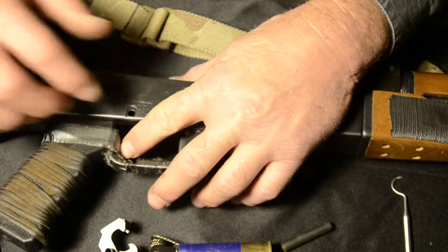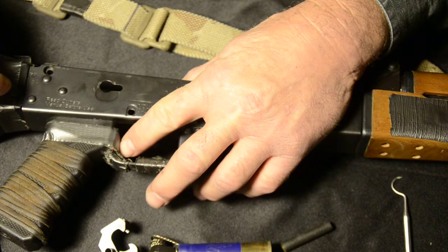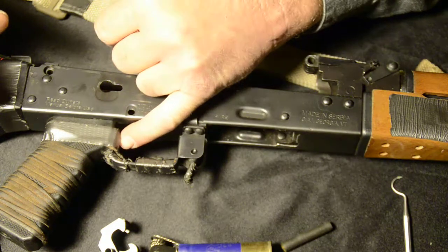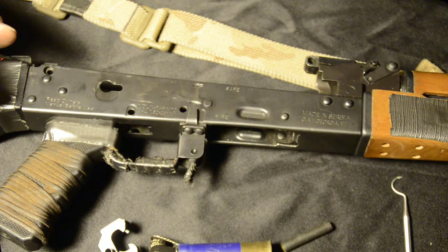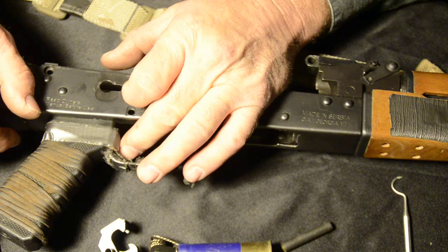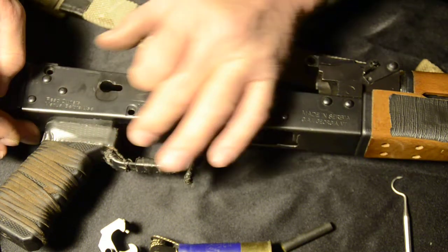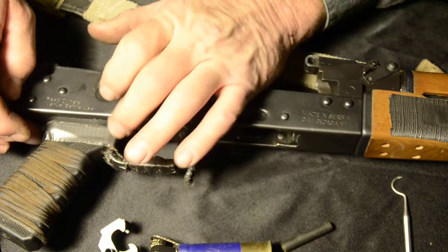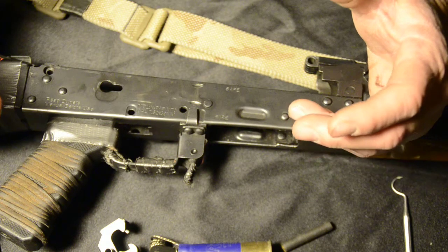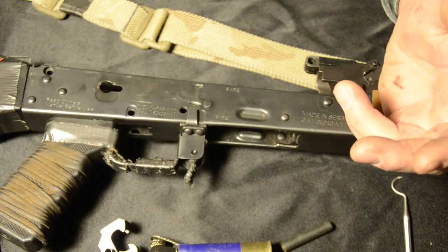Behind the trigger, the amount that the trigger moves from the point that it fires until it stops moving rearward is called over travel. So I put a piece of leather here behind the trigger, and I cut it just thin enough till it allows the rifle to fire and have just a hair of slack, and then I taped it to the handle, and that takes care of a lot of creep and a lot of over travel. And I didn't buy any parts to do this trigger job. I didn't put any money into it. It's just some scrap leather and duct tape.